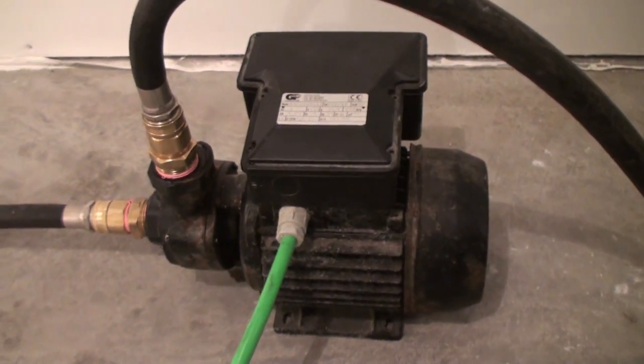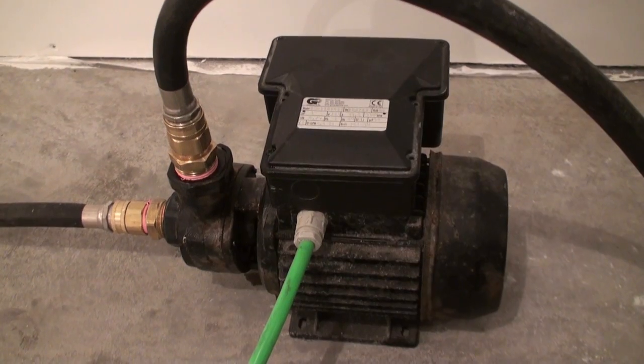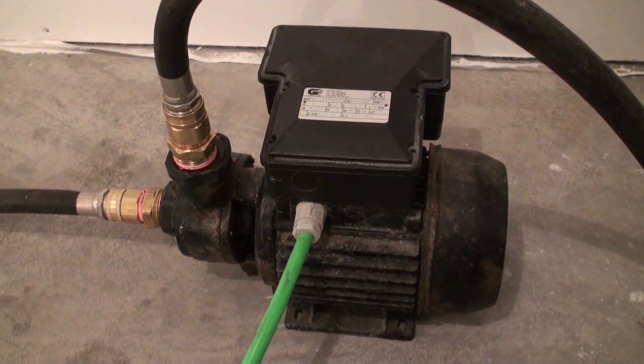I put the garden hose fittings on it and also put on a 12 gauge wire so there's nothing holding this pump back, and I'm using the biggest garden hoses that I had. It pegs the flow meter on my solar controller right over. It's one horsepower - that got my attention - and it's making like 60 psi while it's moving water, so both as a combination, that says something.